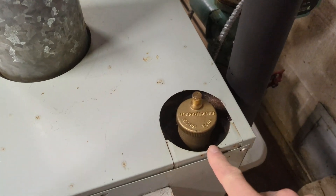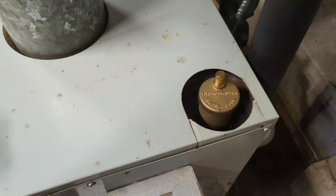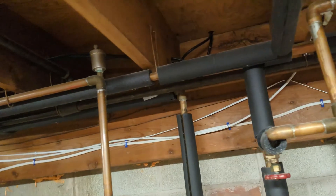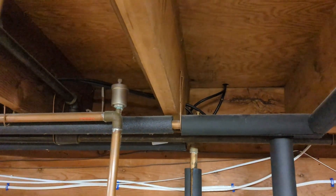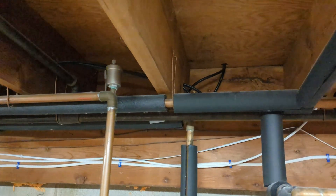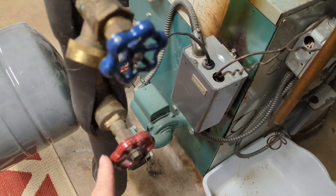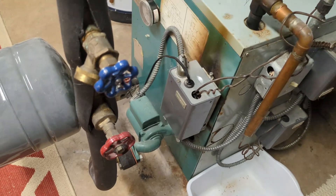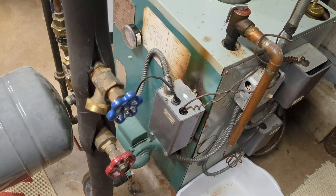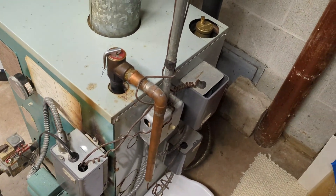You most likely have one of these air vents right on top of the boiler. If there's any air in the system, this will scoop the air out and vent it. On mine, we also have air vents up on top of each zone pipe, and you might also have those at the corner of your radiators upstairs. On your pipes you'll have drain valves and shutoff valves, so if you need to do any maintenance, you can isolate all those pipes upstairs with all that water, close these valves, and have very little water to drain out for what you're working on.